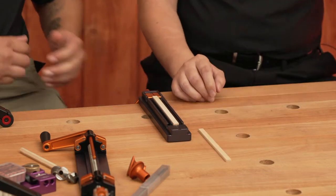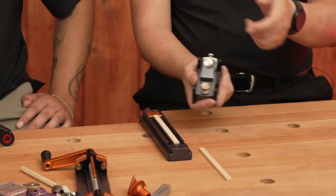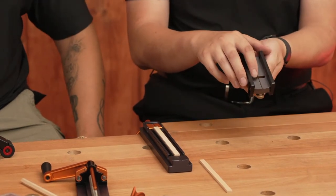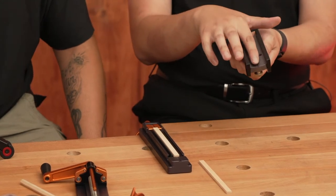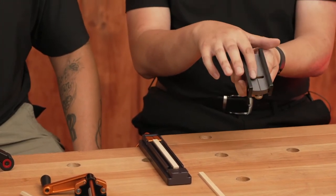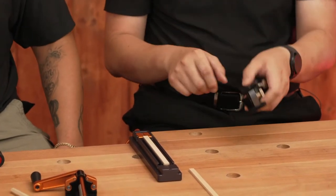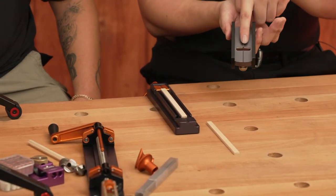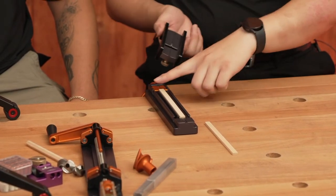When you set the iron, this is a good thing to talk about since we get to this point. Make sure your iron depth is protruding off the bottom and barely making a cut. If you run your fingers below here, you should feel the blade protruding, but not too much. You might want to start off shallow. When you start cutting, you'll see that this indentation will start to cut the channel. But you also want to flatten this down as well, so level it out.